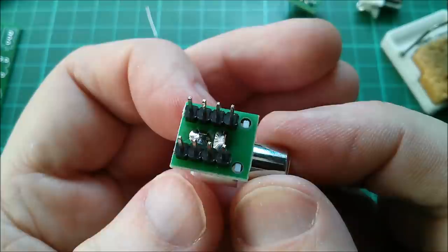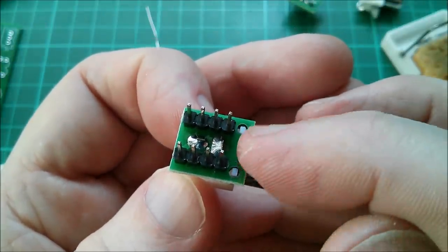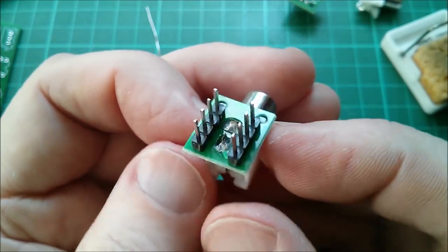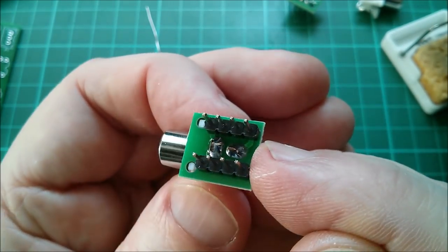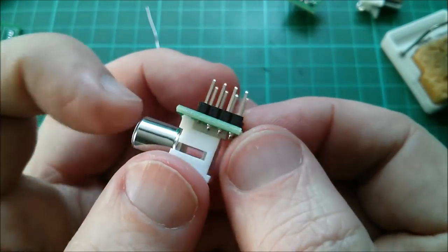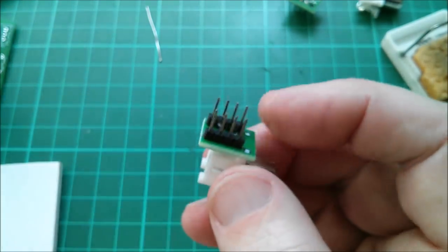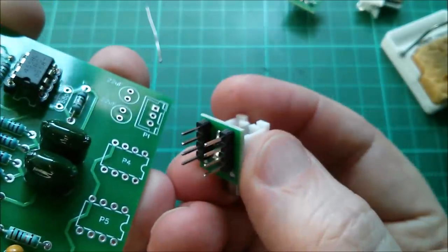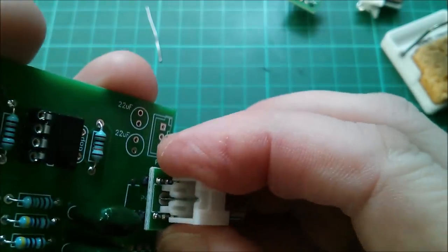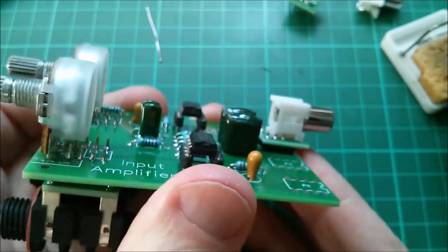There's the end result. Because the hole or slot was wider for that earth pin, it took a bit more solder to flood-fill it. Because I went for a very narrow slot for the signal pin at the back, that one was actually really easy to solder. That looks great - it converts my RCA phono socket into my standardized dual-in-line array. Those aren't extending beyond the pins, so it just drops into there, and I've got phono sockets on my amplifier board.